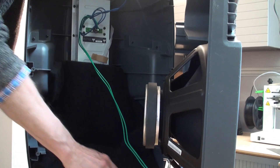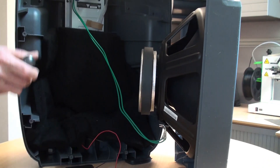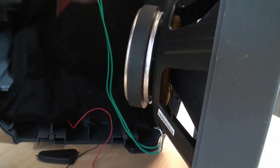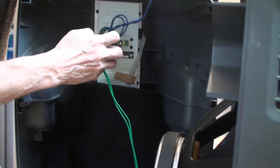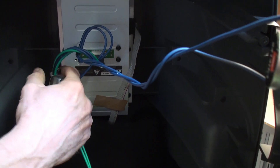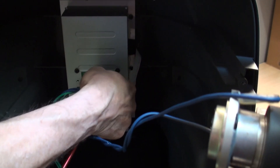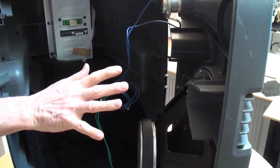We've removed the indicator drive for the front panel, and there's a screw here holding this cable loom assembly into position. It's best not to remove the cables from the speakers and the drive units - it's best just to remove this screw from the top, save the screw onto the cable secure lug, and unplug the speaker. Now the front part will come away from the back part.